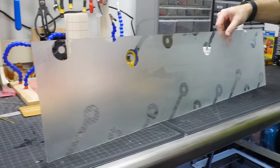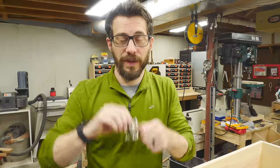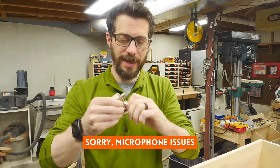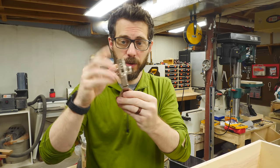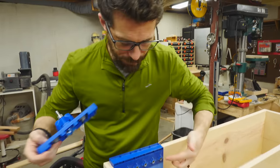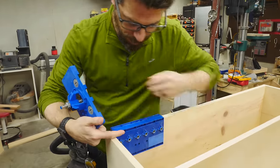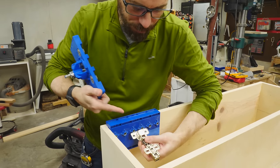Now that we've got the last sticker off, it's time to go put this in the door. But before we can put it in the frame, we have to put on the hinges. We've got these full overlay hinges — this part will be in the back of the door and this part will be in the case. We're going to use two jigs to make the correct holes. This is a shelf pin jig, but it turns out these holes are actually the right spacing for the holes on the hinge.